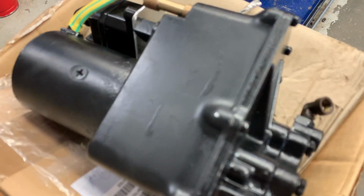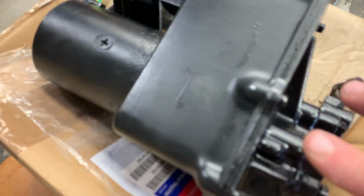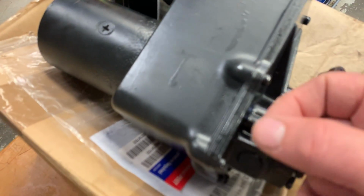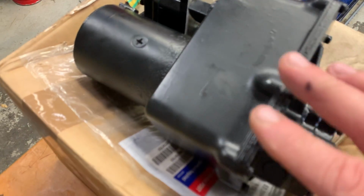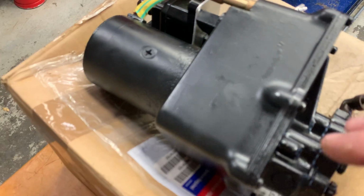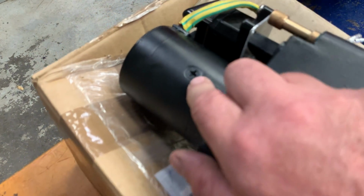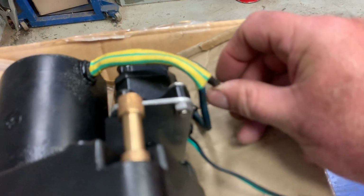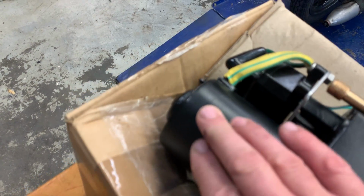So I pulled that bottom plate off, and that exposes that there's one long shaft on the armature that comes down. It's just got two flats on it at the bottom that slip into a gear, and a tiny little gear pump. It's just absolutely dinky, and it's run by this motor. This motor's reversible by two power wires. One goes this way, one goes that way. It's very simple. What was a problem was, I'll show you on the one that's still pulled apart.